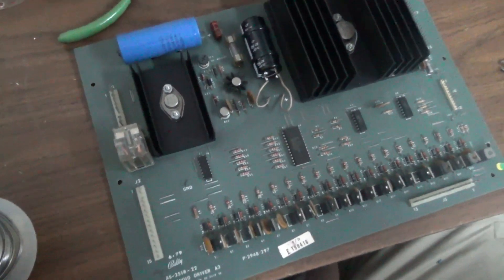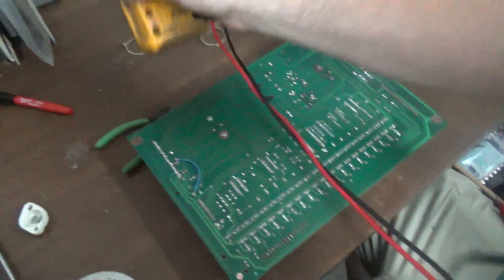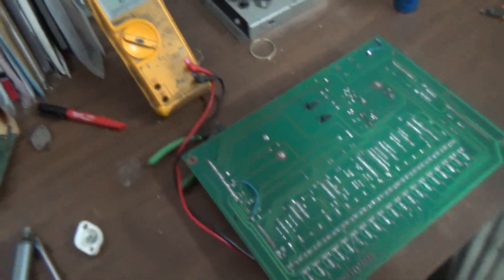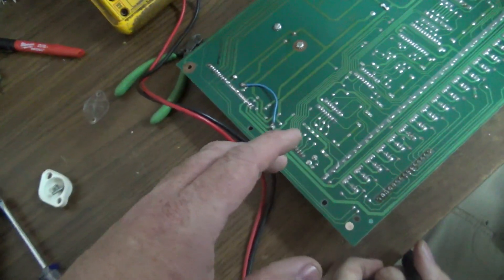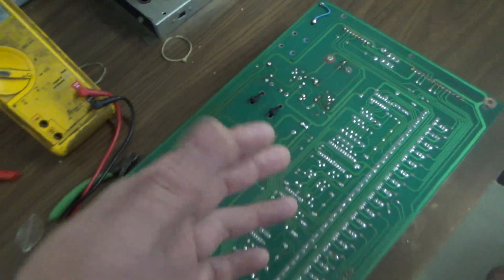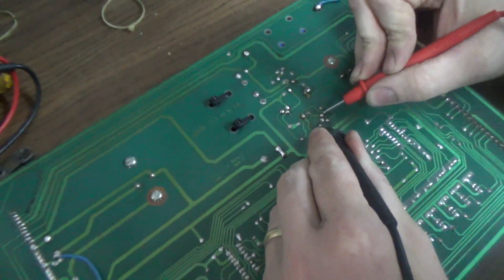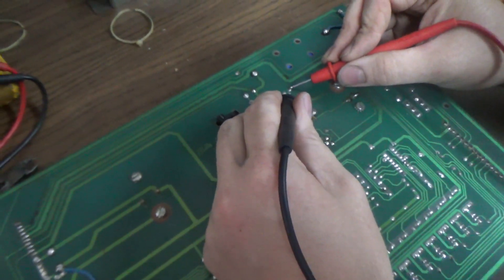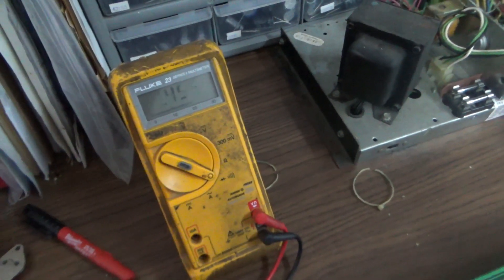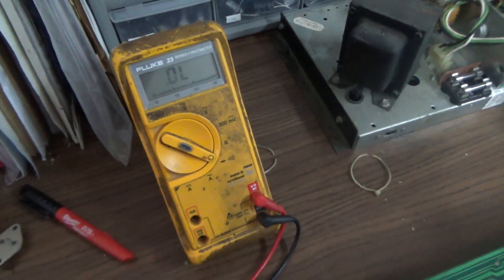The only thing we've got to do now is test. So turn it back over and we'll get the multimeter. This is the one we know works good because it's real dirty. We've set it on diode check, which is how you check diodes and transistors. We're going to check the transistors on the display just to make sure none of them are shorted. A lot of times I'll say base, collector, emitter. All you're trying to do is see if any of them are shorted to each other — and usually if one of them is shorted, the other ones will test shorted too. Try reversing the pins and see if we get a different reading.